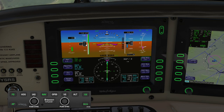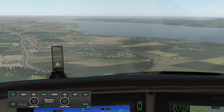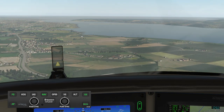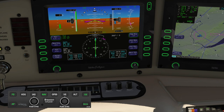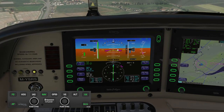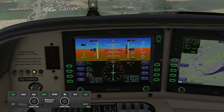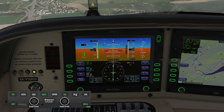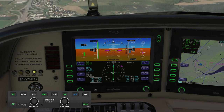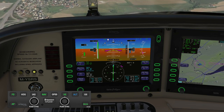Speed is around 100 knots. Because I know I'm going to break off and circle — turn right, fly out over the river, and come back in to land on runway 27 — I'll set the heading bug. I'm looking for a 45-degree initial turn, so 092 becomes 137. To get out of glide slope mode I'll push to sync the vertical speed, go into vertical speed mode, check it's in VS, push Alt to get Alt Blue — Alt Blue, going down to 800 feet. Now it will level off at 800 feet but it's still using the localizer to steer.